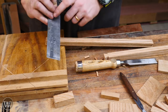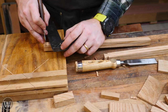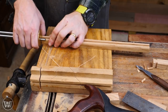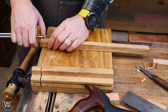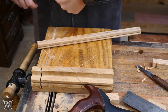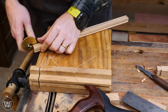Just as with the top stretcher, we're going to start by squaring off the end. I have a whole inch and a half to play with on this one, so I'm going to cut a mark in here and travel that mark all the way around. This mark will then become a nice flush end to this board that I can measure off of. Now that we have a flush end, we need to cut in a half inch — we're basically turning this end into a tenon. So I'm going to make a mark a half inch in on the front face and the back side, and then this needs to be an eighth inch deep. I'm going to mark one-eighth inch in on the end, on the back, the face, and the ends.